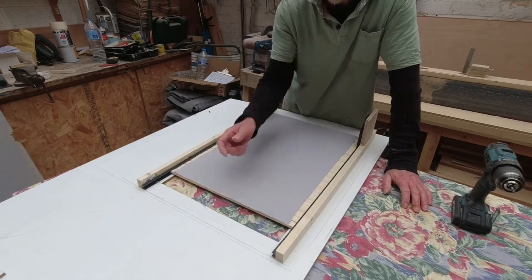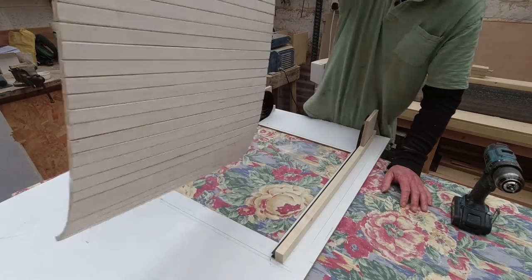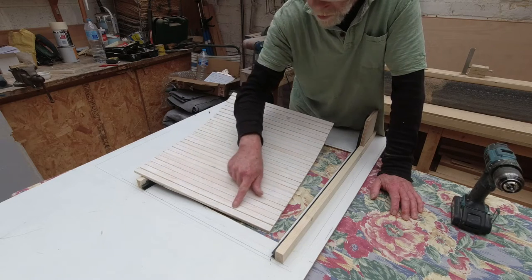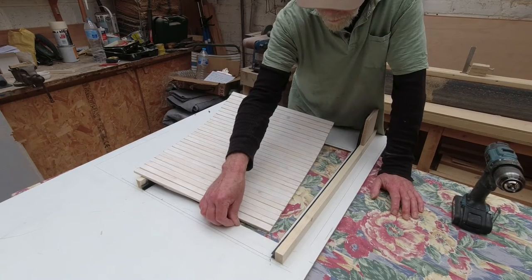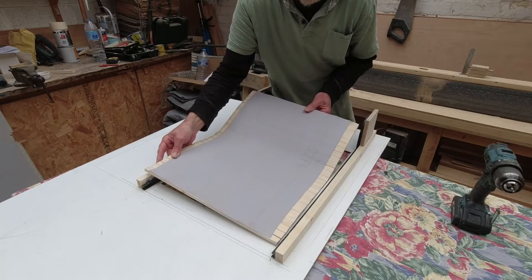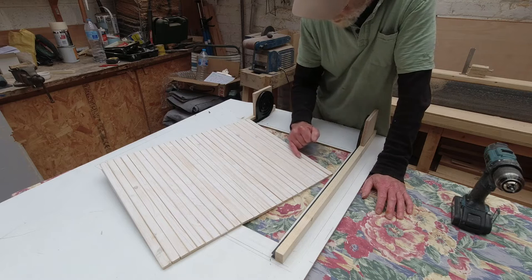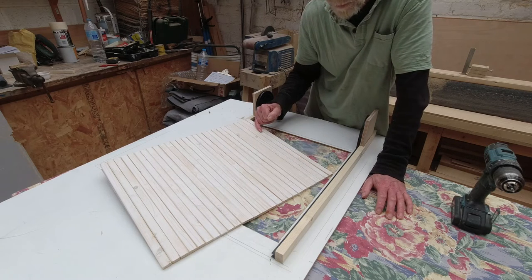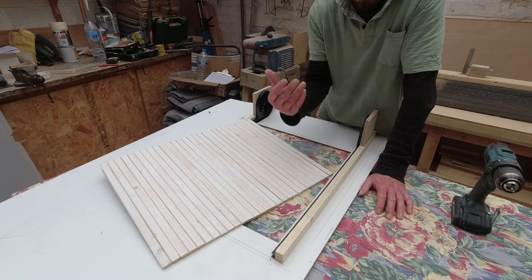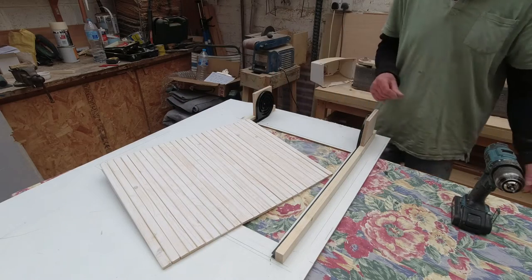The only thing this door wants is a handle of some sort to bring it up and down. I'm thinking just another slat of wood connected to the bottom one — that'll act as a stop at the bottom and at the top, and it's something to pull it up with. So I'm going to cut another piece of this wood and screw it in from the back. I'll have to put the door in first — so the sequence is: cut the wood, put the door in, screw the handle on, and then at last I can get this panel into the van.